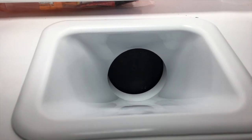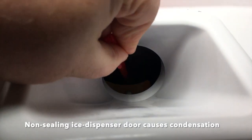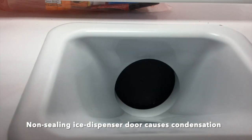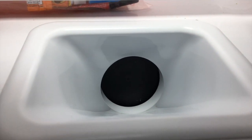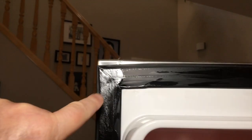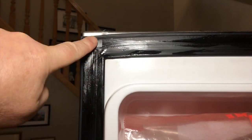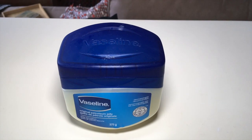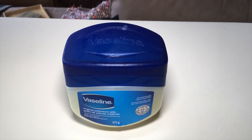You also get warm air in the freezer and therefore frost buildup when your ice dispenser flapper door does not seal, but this one still seals and wasn't used very much in its lifetime. One of the reasons why you get moisture in your fridge could be that the rubber gaskets are worn. So if the gaskets don't seal anymore, you just rub them with petroleum jelly such as Vaseline.